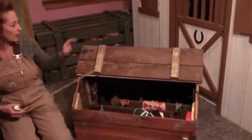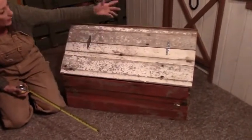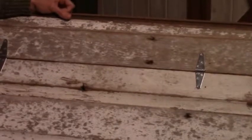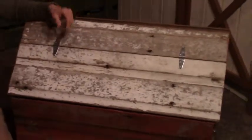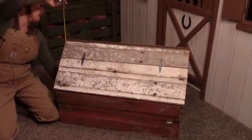The height really just had to do with the tongue and groove pieces I used. This is 100-year-old or older lumber that I bought from somebody who took it off an actual barn up in North Dakota. These are standard 1x6 — which is actually 5¼-inch tongue and groove — and most of the height just had to do with how high I wanted to go up with each T&G board. The height on this turned out to be about 21½ inches tall.